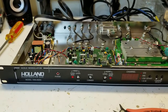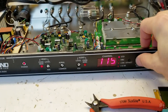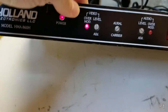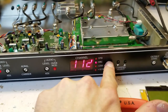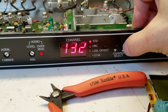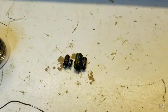Moment of truth - plug this in. Hey! It's awake! Got a power light there. It is over-modulating. There must be no signal going in. And I can change the offset. I believe this works on cable frequencies, being an agile modulator. So it was four capacitors in various sections of the switch mode power supply.